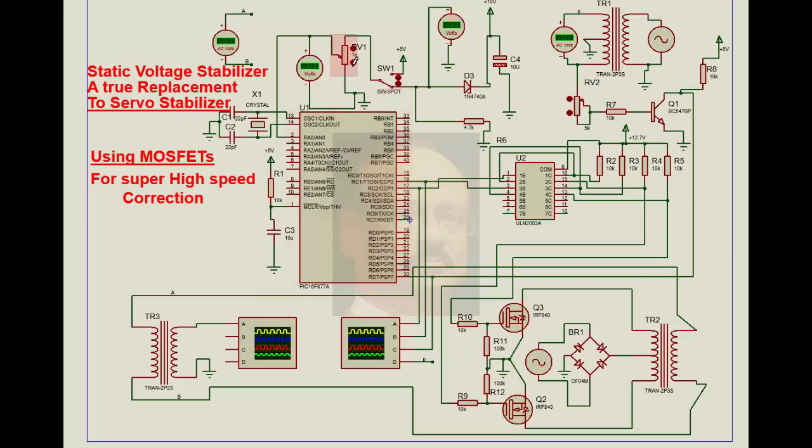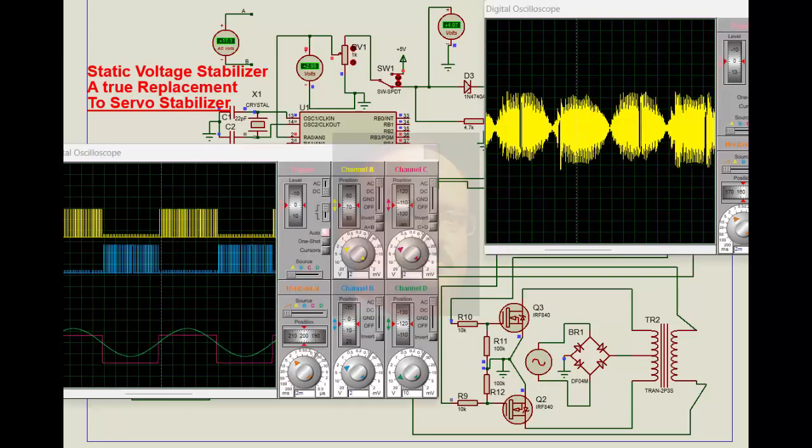We have an arrangement with a switch and a variable resistor. At 5 volts input, 2.5 volts appears at the midpoint — meaning no buck and no boost, input equals output. When the variable resistor is moved above this centre point it will be boosting, and when moved below this point it will be bucking. In real practice this change will come from the actual input voltage connected through two diodes, not from the variable resistor.